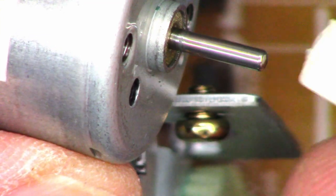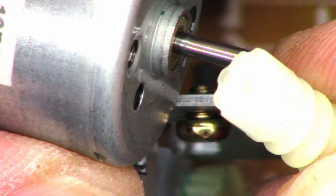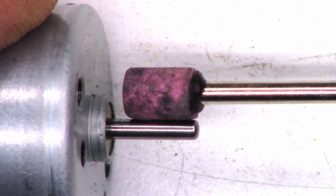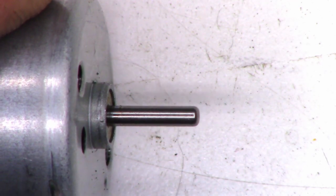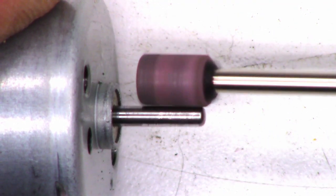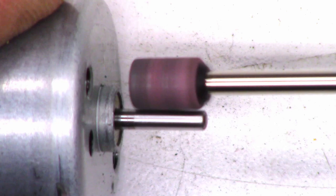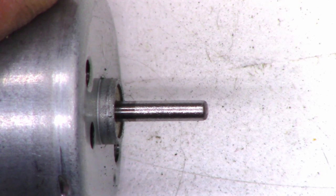So I think we can just go ahead and rough up the motor shaft and rough up the inside of that gear. There's the crack on the inside. I've got my little bit here, and what I'm going to do is just press it against the motor shaft and hopefully it'll turn the shaft while I run it up and down, just to make a little roughness for the glue to grab onto. The motor shaft is all scored — that's what I want. I want the glue to have something to bite onto.